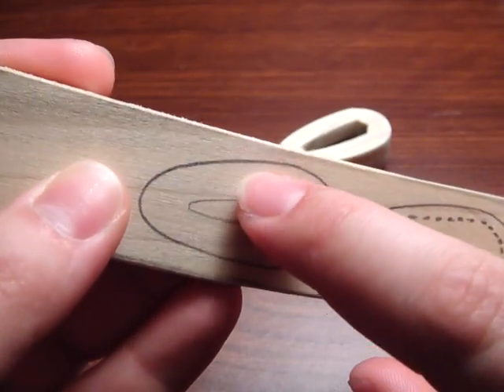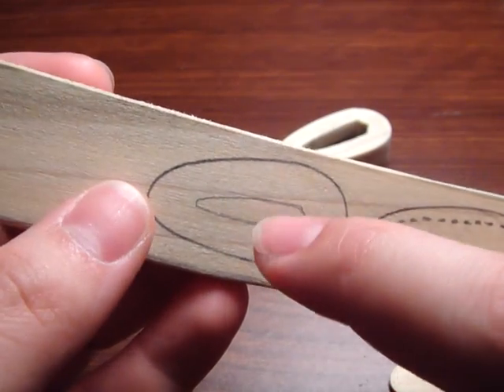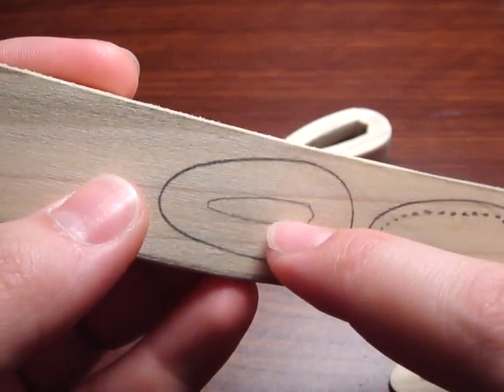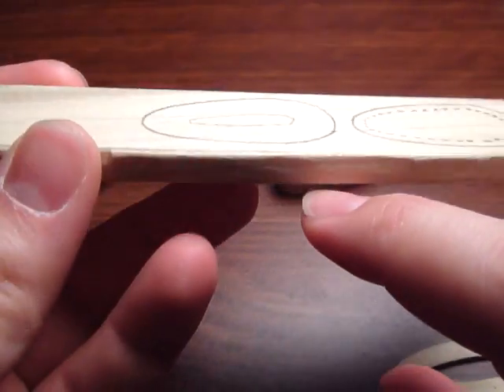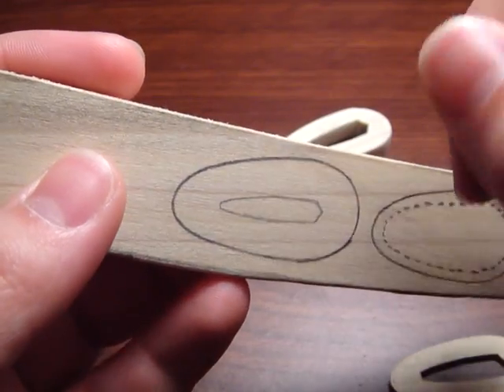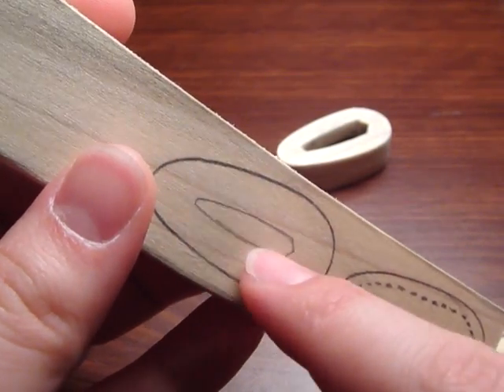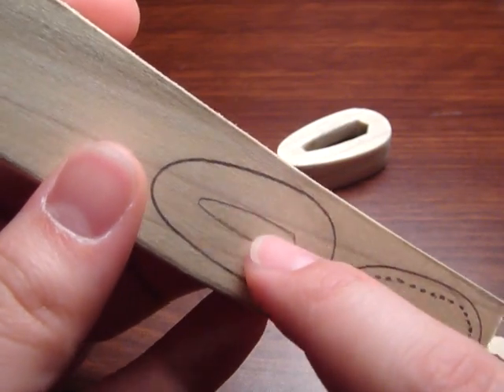For this piece, all you're going to be doing is essentially cutting it out and carving the hole for the tang. You want to keep in mind, like you did for the Tsuba, that it's kind of a narrow gap for such a thick piece of wood, so you just want to be careful that you don't pry against the side and put dents along the outside edge. So just take some care in carving that out.